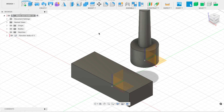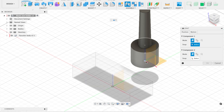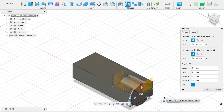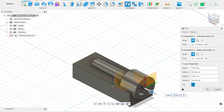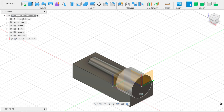Because I don't want to affect my other joined components, I'm going to break the link here so anything I do will be independent of the previous drawing. Now I need to join these two up — using the Join function, shortkey J, I'll select both bodies at their centerline midpoints. The current position is a bit too recessed, so I'll drag it up about 20mm and bring it forward by about 1mm so it just breaks through. Click Enter.